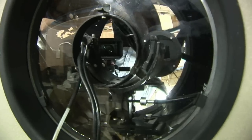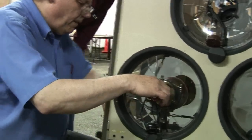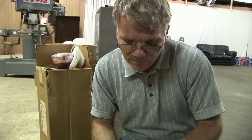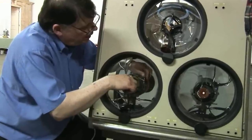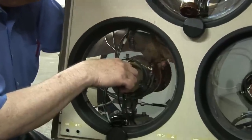How many wires are on that? Six. So obviously that's probably a center-tapped coil for the horizontal and for the vertical. They're just stock gimp coils — they're encased. It doesn't feel like it's broken. We may have just been going to ground — either ground or it has nothing to do with the problem.